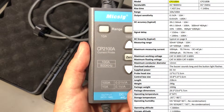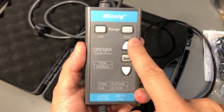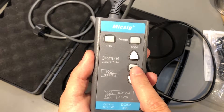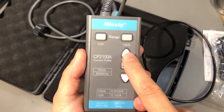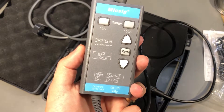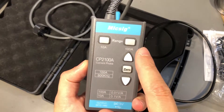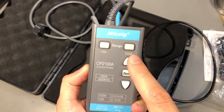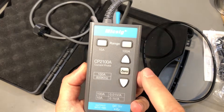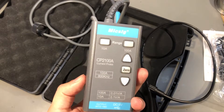It can measure both AC and DC, and it has two ranges: 10A and 100A. There is a zero function on the module for automatic zero adjustment, and you can also do manual offset adjustments with the two arrow keys. MiXSIG specs this at 3% ±50mA accuracy for the 10A range and 4% ±50mA for the 100A range. But from what I've been reading on the forums, it actually performs better than spec — you can pretty much measure down to 50mA without worrying about that ±50mA, and we'll put that to the test.